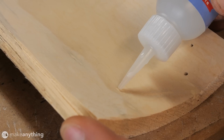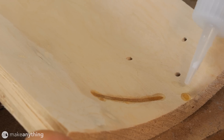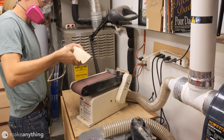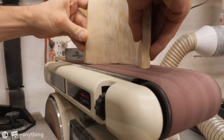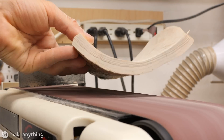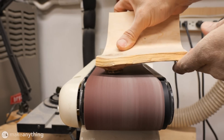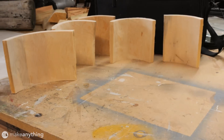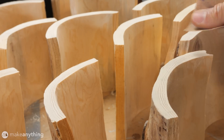As with my last woodworking project I did have a few pieces with beetle holes, so this time I soaked those with super glue before sanding them down a bit further. This thin Star Bond glue absorbs into the wood really well. Now it's time to sand the ends of the wood using a belt sander with an 80 grit belt. I manually oriented the parts until the top and bottom edges were completely flat, making sure the pieces could stand upright on their own, and I also flattened the ends of any branches on the back. With that my pieces are nice and smooth, with just a tiny bit of hand sanding at the end to clean up the edges before it's off to the laser cutter.